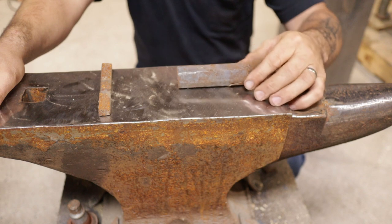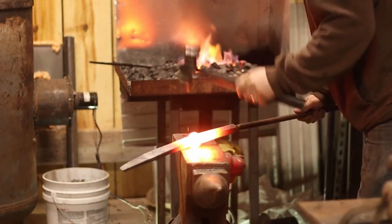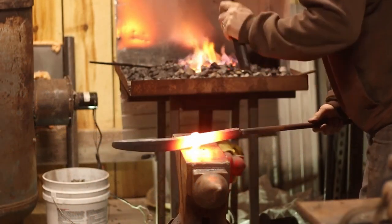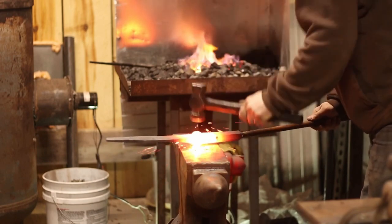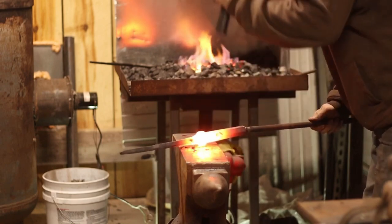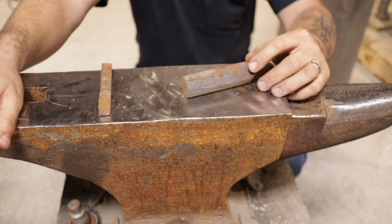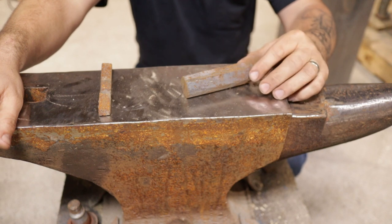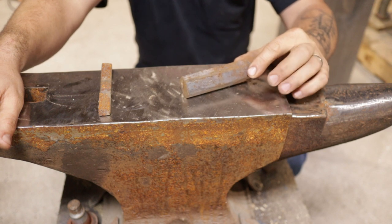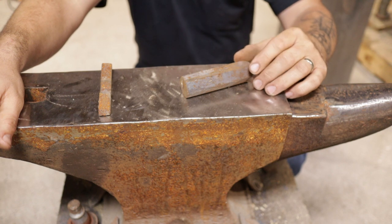Next down the list, this is a jackhammer bit that you guys saw me forge out a drift with about a year and a half ago, or 2 years ago now, I guess, for doing small hatchets and things like that, a drift for the eyes. This stuff is very hard to work. It's very hard to pound. You need to get her nice and hot. Heat treating's a little different. It's not too bad. I believe this is an S7 steel, if I remember right. But this is really good stuff for high impact. So as far as for drift material, this stuff is absolutely perfect.